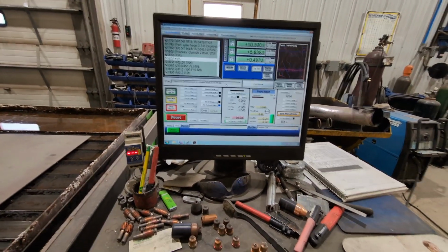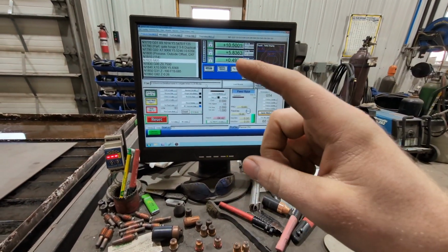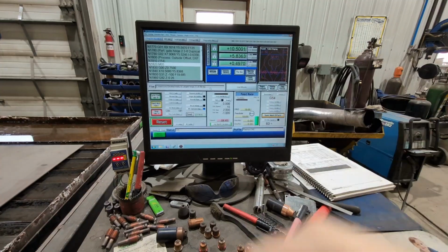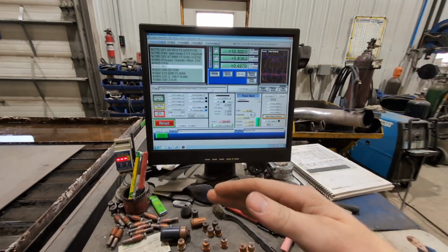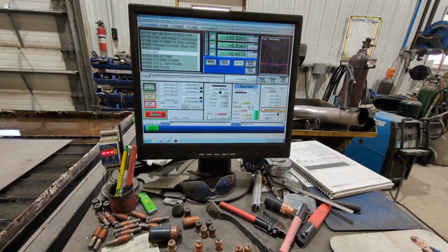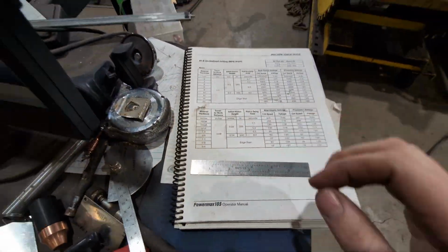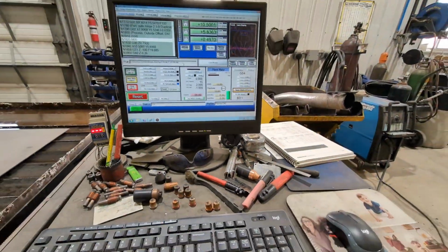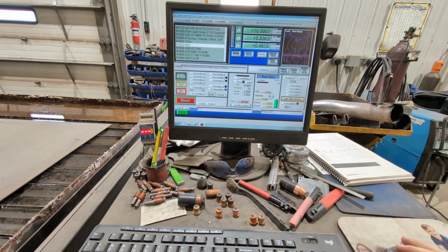So again, diving, voltage up. If it's lifting, voltage down. Higher voltage is higher cut height. If you're having trouble, you've got to adjust that to get it to move into the right height. So is it the right height? Well, to find out, you go to your book setting and then take that book setting, make a test piece, and I'll show you guys my test piece real quick too.